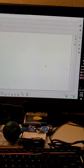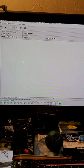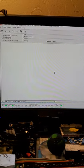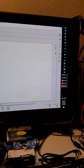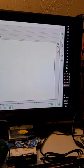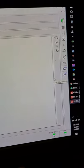What this does is basically allowing us to understand what zones on the disk inside the hard drive belong to what head. So this way we can test more specifically to see if head 0 and head 1 are reading correctly. Okay, so see how they popped up once we build the heads map. So head 0, head 1. All right, so you can see there.